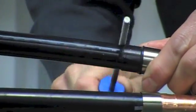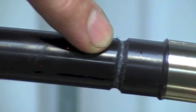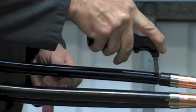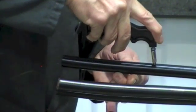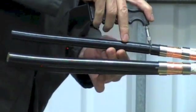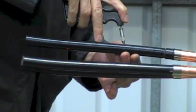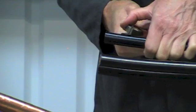Do not use a sharp knife or a Stanley knife to do this. This is a very critical point of the joint installation. Scoring tools are available with a blade set at 0.4mm so it doesn't score the core beneath. Make three or four tram lines down the length of the core to make it easier to remove.